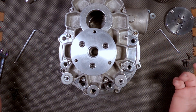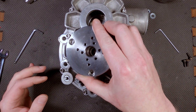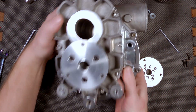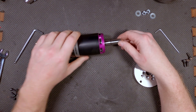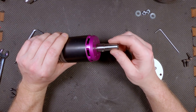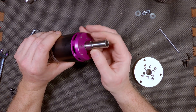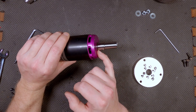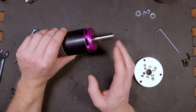This is the subplate, if you will. And this motor plate also has a concentric lip on it, and that fits in nicely. But before we bolt that on, obviously we have to bolt the motor together. Much like the original drive, this one is also a 10 millimeter hex drive. It's a similar concept, except this time I just used an actual impact socket and turned it down. High-speed steel doesn't touch this - this has to be done with carbide tooling. But it turned out very, very precisely. I got a miniature boring bar and bored out the shaft to the perfect size. There's a half a millimeter clearance between the bearing and the end of the shaft, and about a millimeter on this side before it bottoms out.